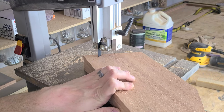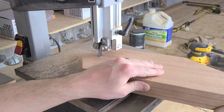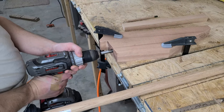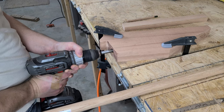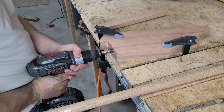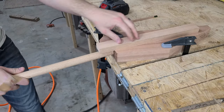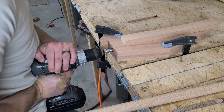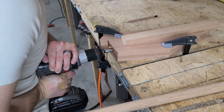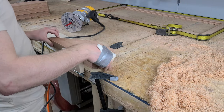We now use a bandsaw to remove some more material from these pieces. We could cut right on the line, but we want to make the pieces uniform and we don't want to spend a bunch of extra time sanding out bandsaw marks. So we cut next to the line and then trim them to size with the router later. Unfortunately, we couldn't drill very deep earlier due to the extra material on the board and the secondary board that we used for support. So after cutting off some of the extra material on the bandsaw, we clamp each of these boards to our workbench where we'll have to drill out the last few inches by hand. We stopped periodically to check our progress and make sure we weren't veering up or down. Thankfully, we managed to get through all four boards without messing up any of them.